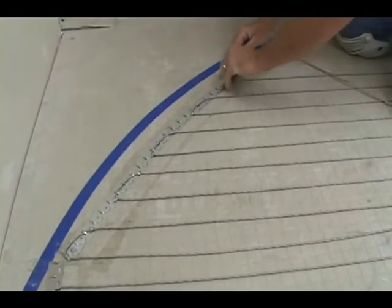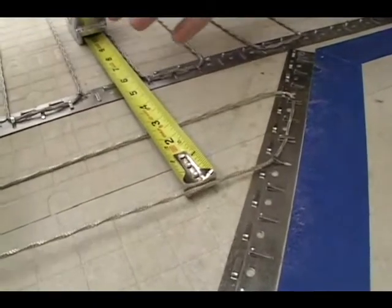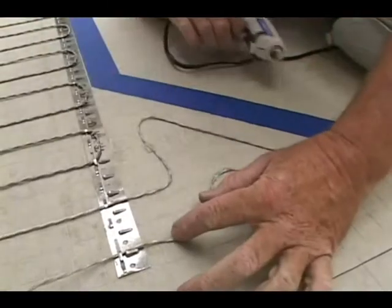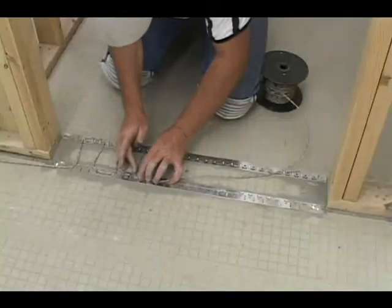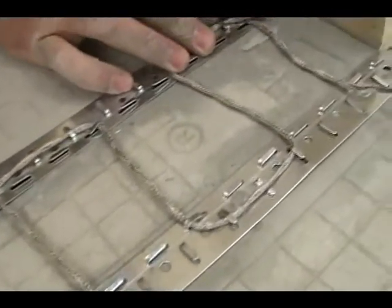In the case of a circle, cut short lengths and follow the perimeter. Make adjustments to the tab spacing to keep the wires two and a half inches apart. At odd corners near the island, we use hot glue to secure small sections of wire. When you have a door entry, cut the straps to fit the space between the rough opening and then run the heating wires in parallel.